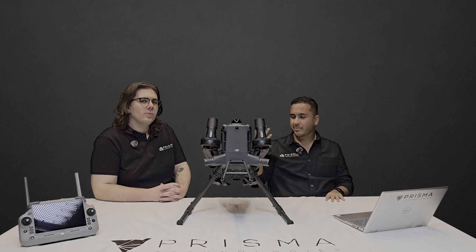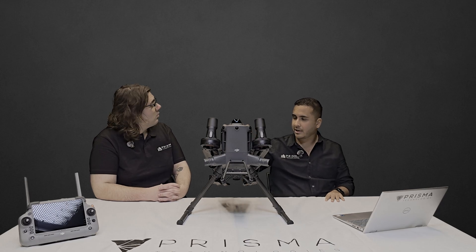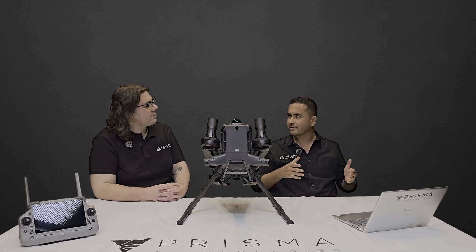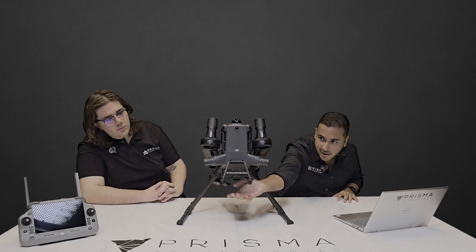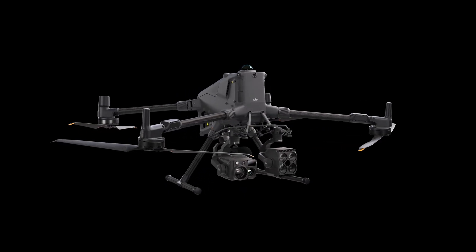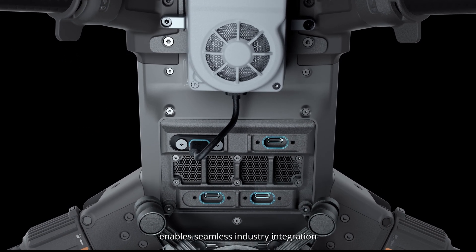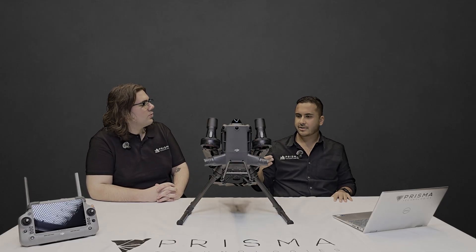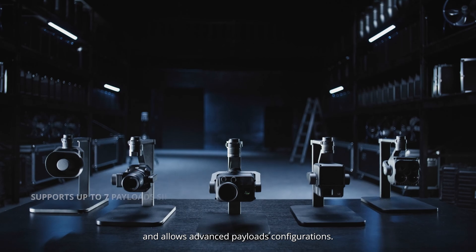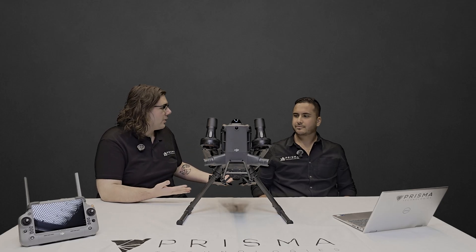The reason I hearken back to the Matrice 600 is because that had a six kilogram payload — so does this. That's a massive step up from the 2.7 kilogram payload of the Matrice 350. That allows us to now carry seven total payloads. You could have a dual downward gimbal mount and a third gimbal mount facing downwards at the bottom of the aircraft, in addition to some e-port mounts as well. This currently supports all new DJI Zenmuse payloads, such as the Zenmuse S1, V1, the H30 series, the P1 and the L2.